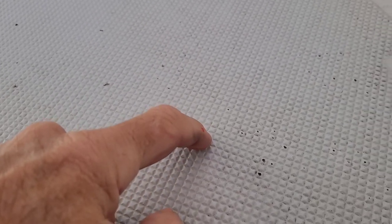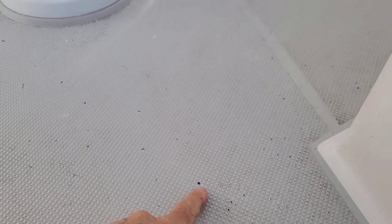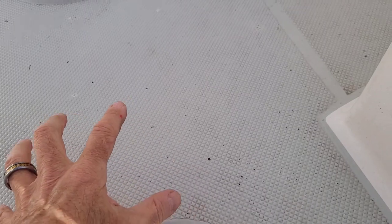If you look at the floor here, you'll see some little potholes — pinholes — and what causes those is two things. Normally it's inside the gel coat. It's not a manufacturer's defect, but sometimes there are little miniature air bubbles or air pockets just below the surface of the gel coat. Along with wear and tear over 27 years, sometimes little stones or debris underneath your feet or shoes will exacerbate the effect and pop these little holes open.